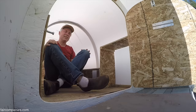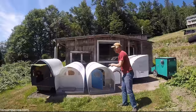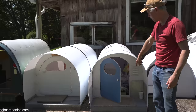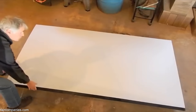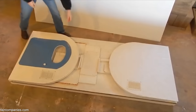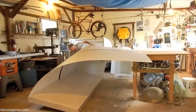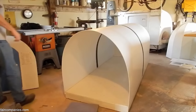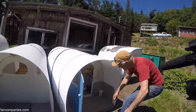Nobody knows about it except the people you tell, so you want to be able to safeguard their night stay. I want to be able to manufacture them a little faster. I used recycled wood, but it wasn't too much money to buy a few 2x4s and another sheet of OSB — that way I was able to make this one collapsible. This is how it collapsed and delivered to somebody, and this is how you put it together: screw one side down, find the old holes, roll it over, then attach the panel to the other side. A person could use piano hinges to secure the two side walls — that'd be handy — but here, being a prototype, I just did it this way.